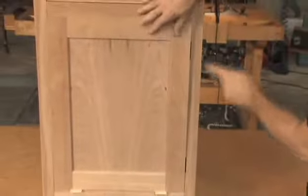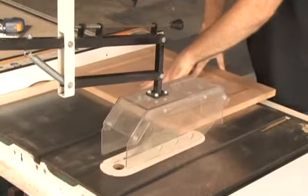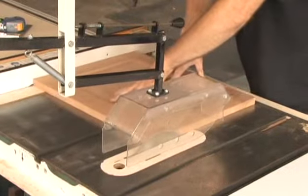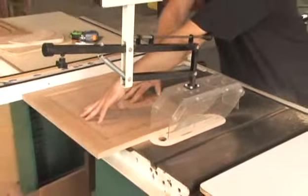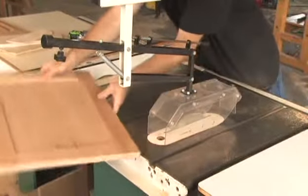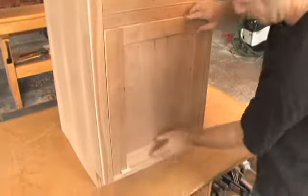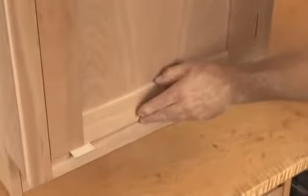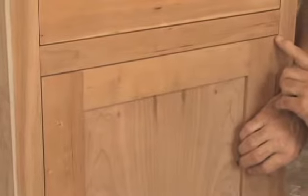When the hinge side and bottom gaps are consistent, trim the top of the door to create a gap of about 1/32 of an inch. If the top and bottom edges of the opening are parallel, and the amount of material you need to remove is significant, you can trim the door on the table saw, registering the bottom edge against the rip fence. Otherwise, use the hand plane again. Keep checking the fit as you go, holding the hinge stile tight against the opening and looking to see that the gap is consistent along the stile and equal top and bottom.